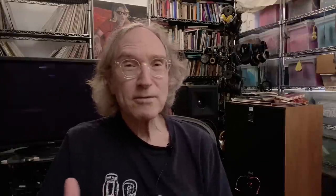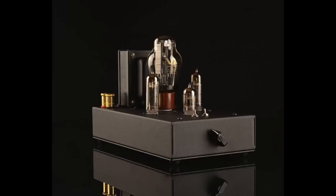Then I thought, I do have a Schiit Aegir here — what if I put the Aegir on the bottom, on the woofer, and put the Zen Triode on the top, on the mid-range tweeter? As I said, two identical amplifiers is by far the easiest way to do this. But since the Zen Triode has a volume control on the front, I could more or less match the level of the Aegir with the Zen Triode.